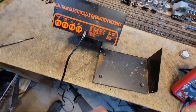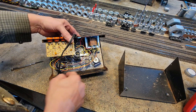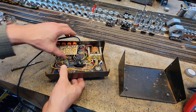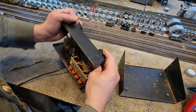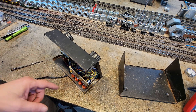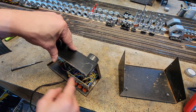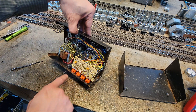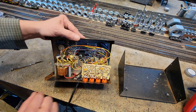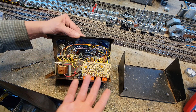If I'm going to put in a new transformer, we'll probably replace these components even though we've never really used the momentum on this. On the AC output there's a bunch of diodes that are probably used for the AC function, plus various capacitors on the board. We can recap the whole thing - replace all the capacitors, take the sockets out and clean them so they're perfect. We'll have to empty everything out of the case and get rid of the rust - we don't want rust in there.